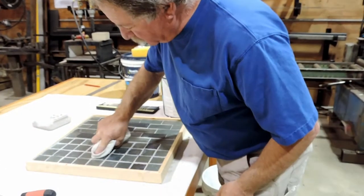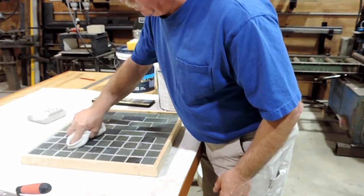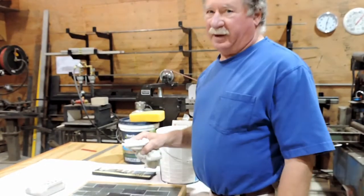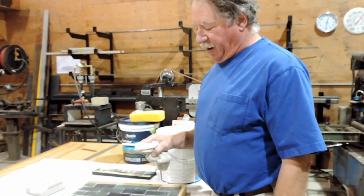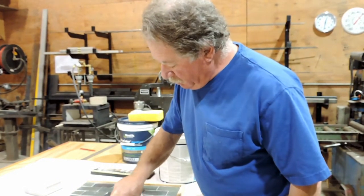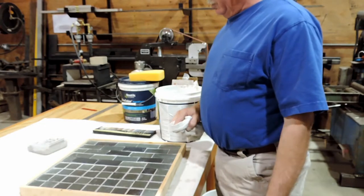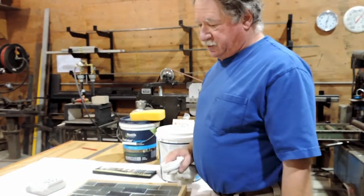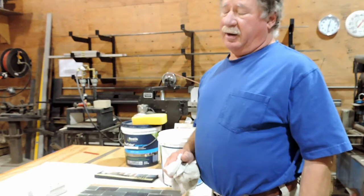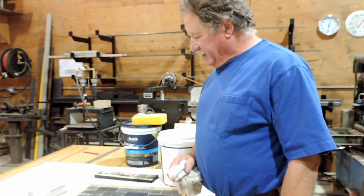You'll do the same thing here — use your finger and go through each one. When we do this on job sites, we use burlap bags — they're the ones that work the best. We wait four or five hours and then come in with burlap and buff out the tile or stone as best we can. After we're done, once again make sure all your tools are washed off. If you manage to get grout on your clothes, go ahead and wash them with water right away and it'll come right out — if you let it set, it's more difficult. And that's our grouting lesson for today.